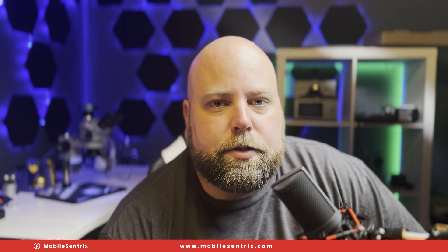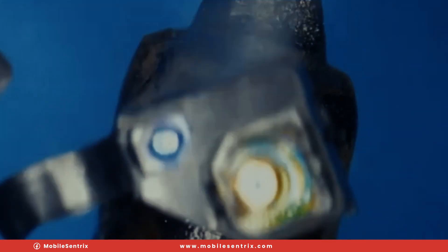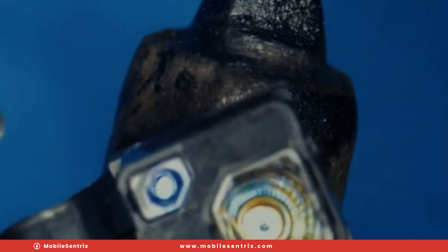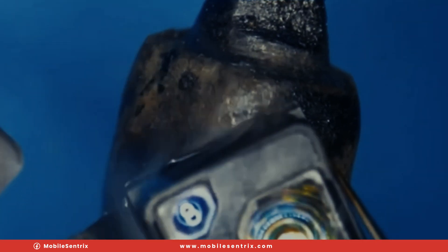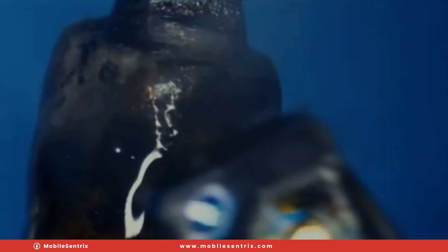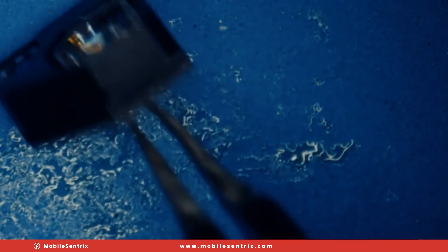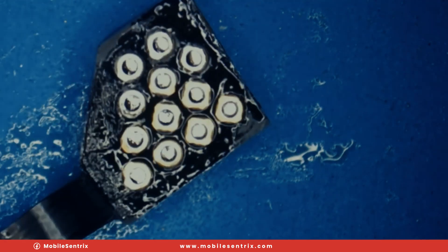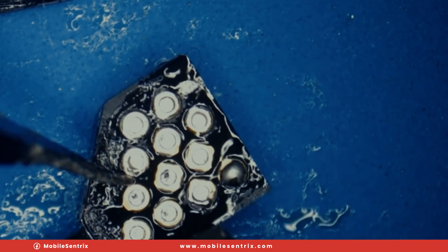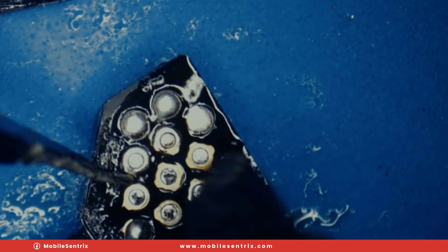The process is pretty straightforward. You can place the backside of the proximity sensor on top of the soldering iron, and it doesn't even have to be on the tip. The shaft itself gets hot enough where you can solder from it. You simply place it on there, all of the solder will melt, and you'll be able to pull it off. Then you simply have to line it up with the new proximity sensor, add flux and solder. It's really straightforward because the orientation can only go one way.